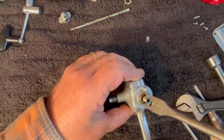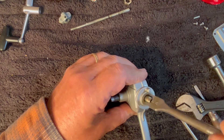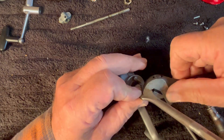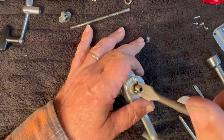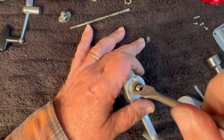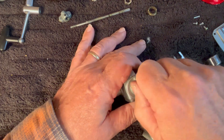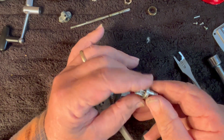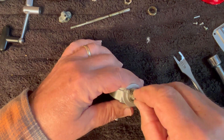Basically, I broke it loose using this tool and I can put it back in the same way. All I did was grab hold of it up here at this end with my wrench and crank it. I got it to break free. I'm sure somebody makes a spanner that fits this thing perfectly, but I made one out of a 5-inch drill bit. Let's get that out. We should be able to pull this out. Now this has a bearing in the front, and there is a bit of wobble in the bearing when it's in here.